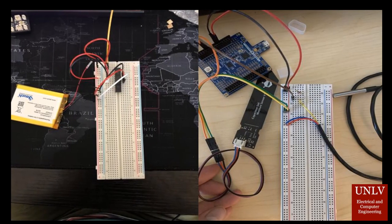For the microcontroller sensing nodes, we used an ATmega328PB board connected to a waterproof DS18B20 temperature sensor and the waterproof SEN0193 soil moisture sensor. The soil moisture data is read in using the ADC module in the microcontroller, while the temperature data is read in using a one-wire interface. After reading the data, it will have to be formatted in JSON and sent via BTLE to the data concentrator node.